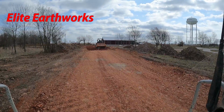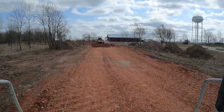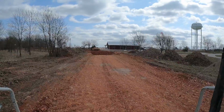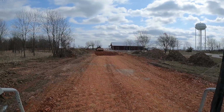All the clay in there. I don't know, pretty much up to grade. Now we're gonna go back around and make one more lift, probably. I was shooting for like 6 to 8 inches higher than the existing grade. It's like super windy. I have my laser set up. It's already blown over twice, so.